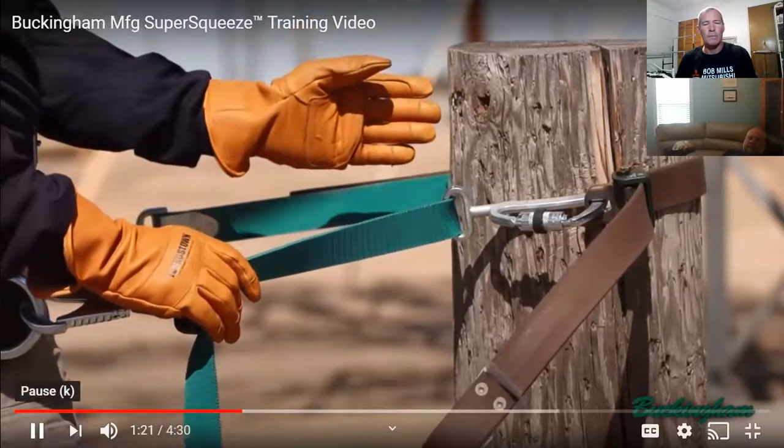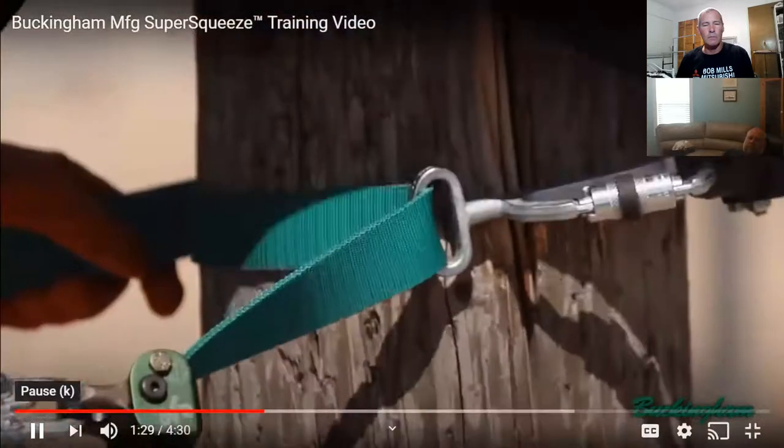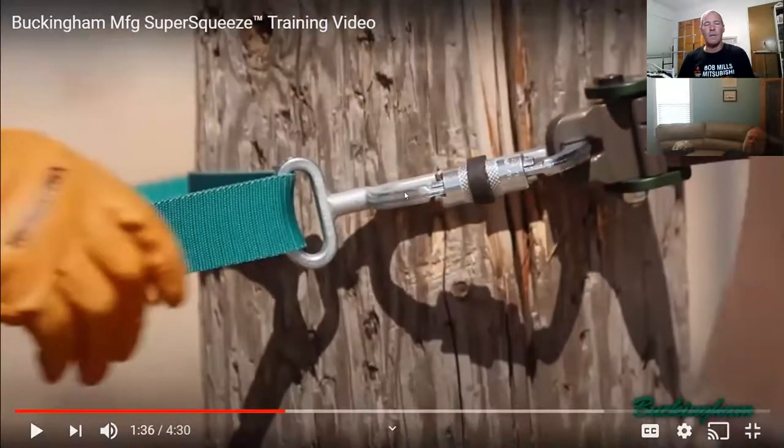Take your elbow and place it between your stomach and the pole with your fingers fully extended. From here you can adjust as needed. To shorten the outer strap with one hand, pull it toward the back of the pole. To lengthen, release the web grab while slowly leaning back to the desired length. If you're too close to the pole and want to readjust back, give it a good adjustment backwards — maybe two or three inches depending on how much you're making contact. If you come away from the pole too much, make small adjustments back up to tighten it.